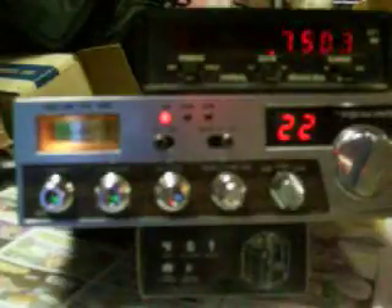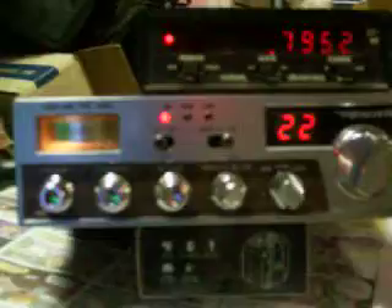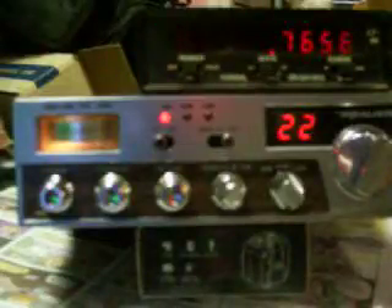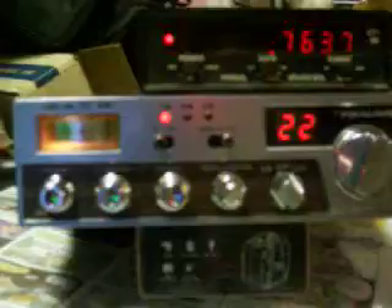It's pretty simple. Instead of dealing with pin 19, you can look at the schematic — pin 19 will give you 40 channels, pin 20 will give you 80, pin 21 will give you 100, and pin 22 will give you 200.